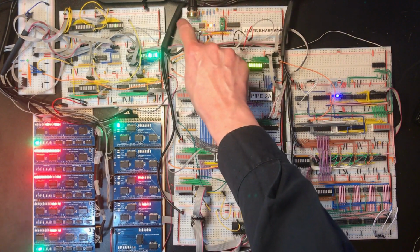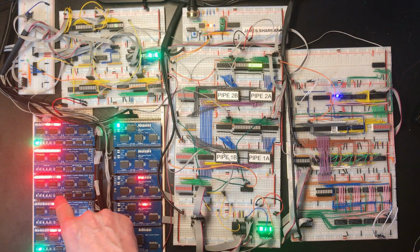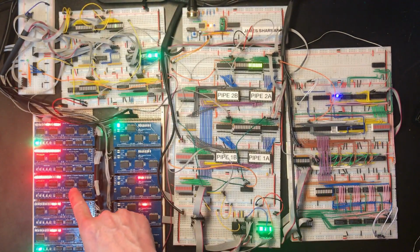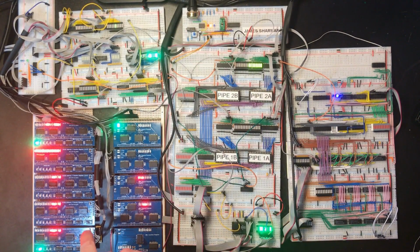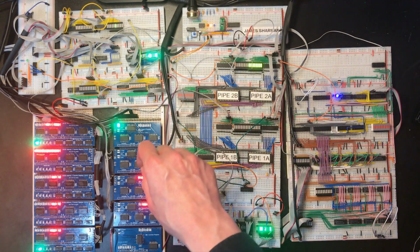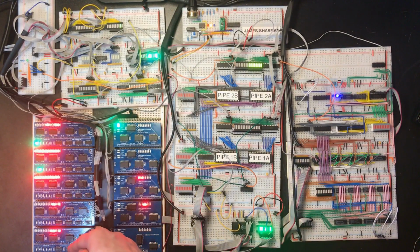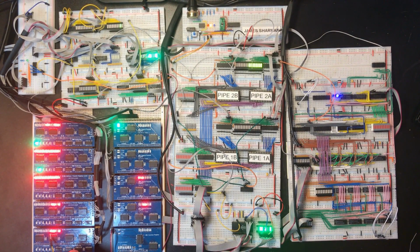Let's kill fetch again. Let's tell this one to load it. Let's load that to there. So same thing has happened, we haven't got that bit. Tell this to assert, and that gets the whole thing. So on this one, we've got bit 5, which is the second bit on this chip, isn't getting asserted back to the transfer bus. Now, it is coming out onto the LED, so that's going to be either this pin or this pin. What's the betting those are dodgy?